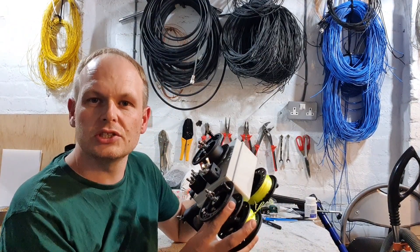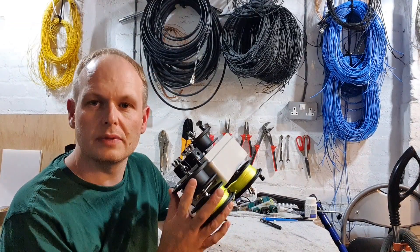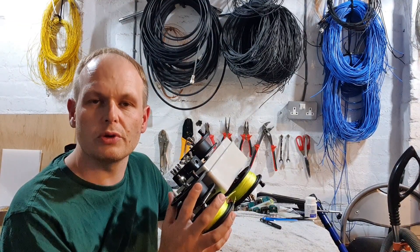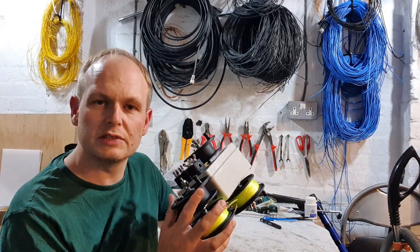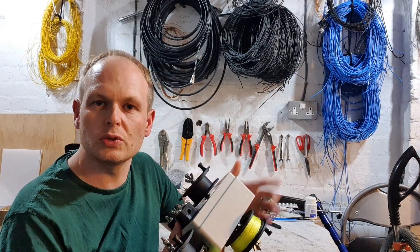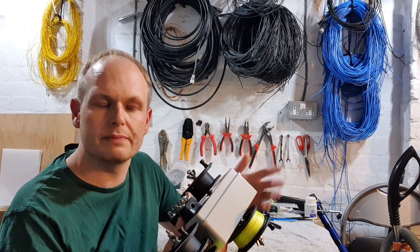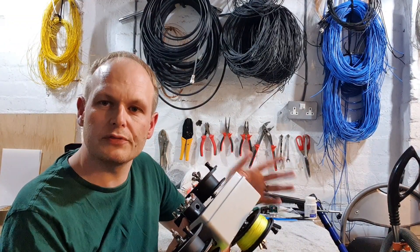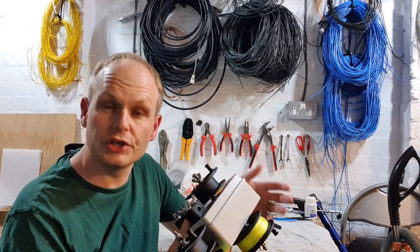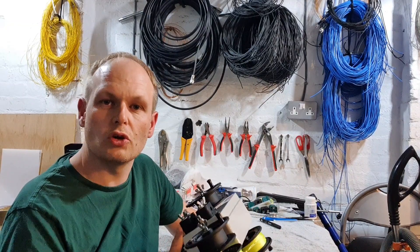If you're not aware what this is, this is an adjusted wave antenna that I like to use. It's simply a quarter wave vertical with a single quarter wave elevated radial, or you could ground mount it and use ground radials. It's quite simple but variable length — it works on a pulley system so you can adjust the length on the fly. You could work any band on this from 80 metres through to 4 metres. After 40 metres, on a 12 metre spider beam pole, you could run 80 metres because you go all the way up, across, and back down again. It makes quite an efficient compact antenna for 80 metres.